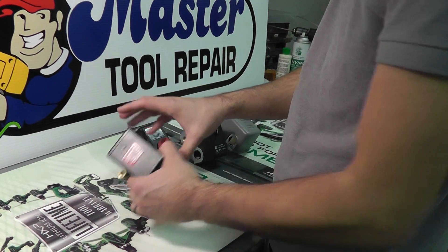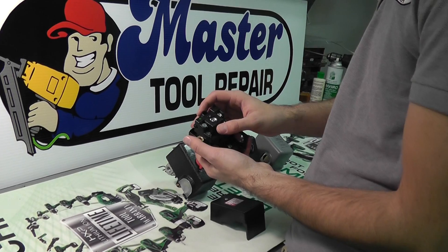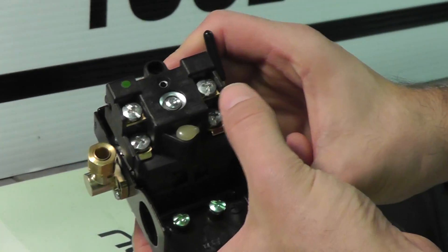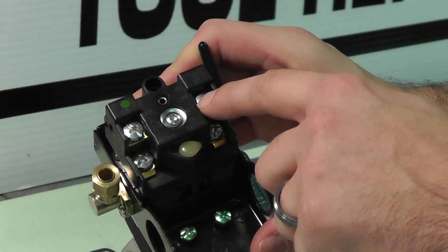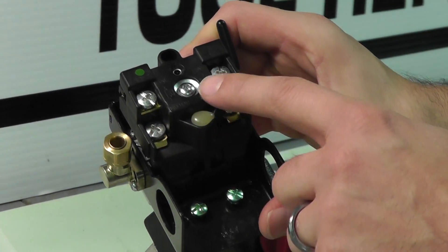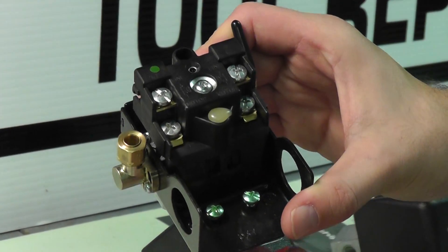And of course, wiring a pressure switch is pretty simple. All of our pressure switches will wire for either 110 volts, 115, or 230/240 volts, labeled pretty clearly on the contacts. Here we have two wires for the line up top for your power cord and two lines for the motor — the black and white for your motor. Pretty simple. And two ground wires for your ground.